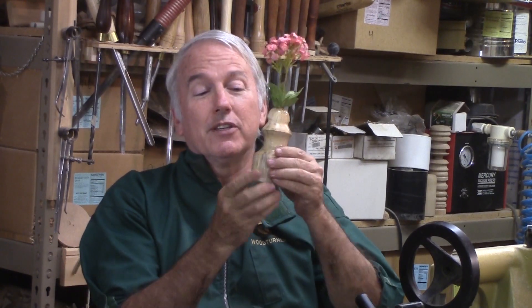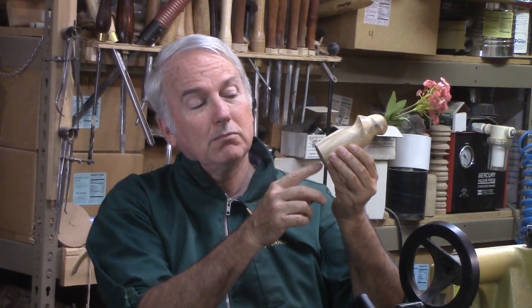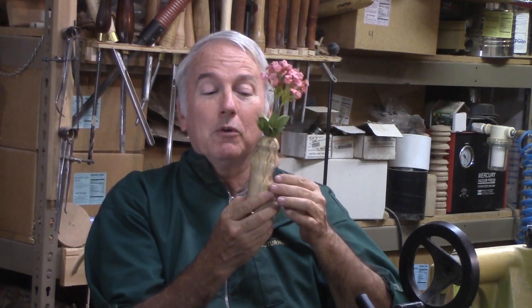Now, this one is an advanced bud vase, not the one that I would have had him make, because this is an eccentric turning. This has the main axis plus three axes at 120 degrees apart, offset by about three-eighths of an inch. Makes for an interesting figure. Plus, this is birch and is spalted and I think it's quite nice. So, let's make an eccentric bud vase.